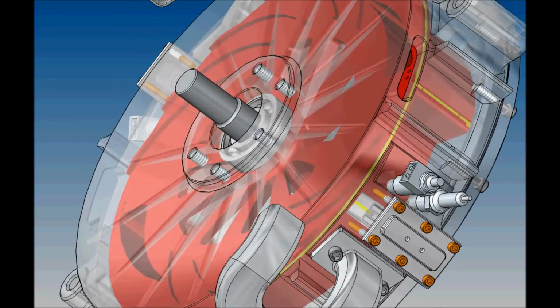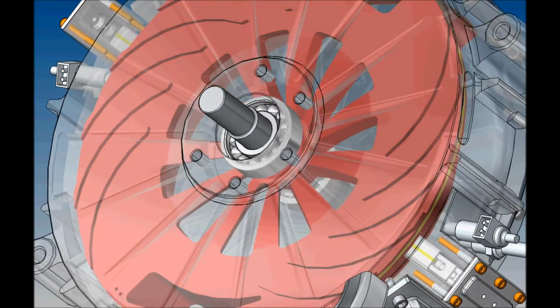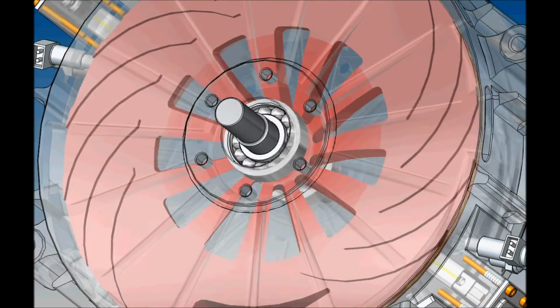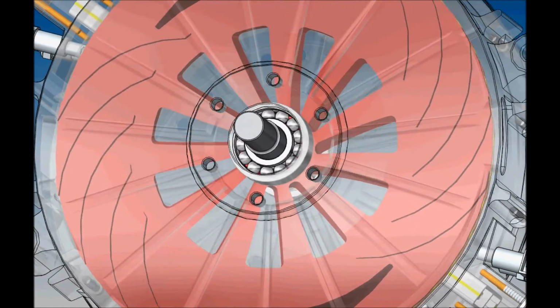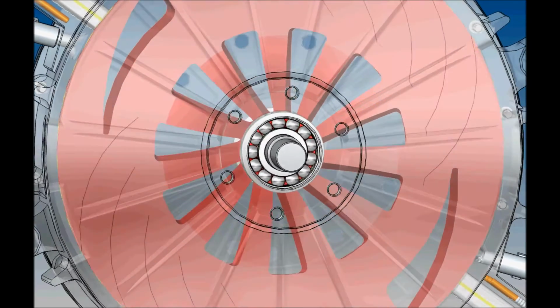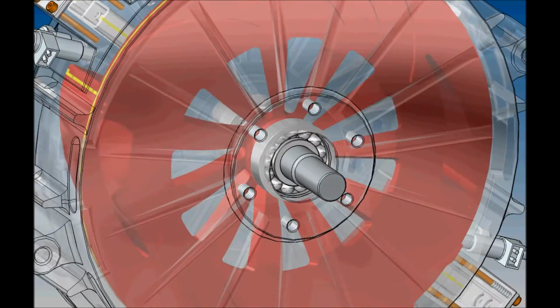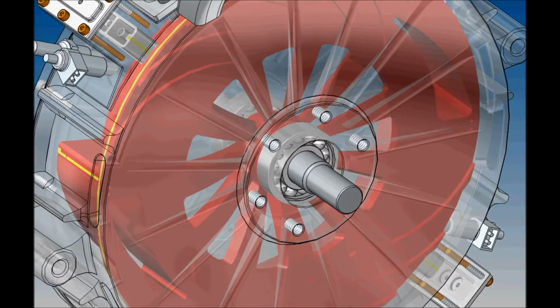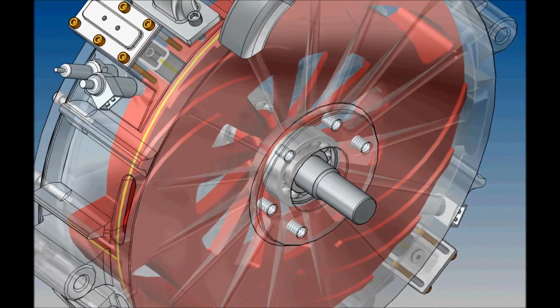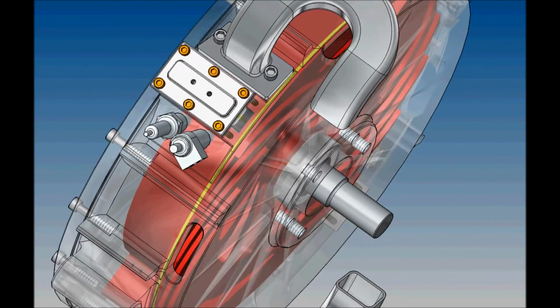The cold zone is on the interior side of the cam and performs the function of suction and compression. The hot zone is on the outward side and performs the working cycle and exhaust. All cycles work symmetrically because this engine has two combustion spaces and two compressions.